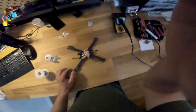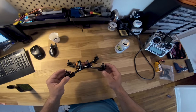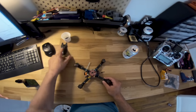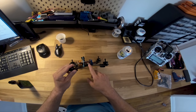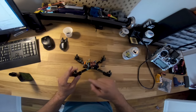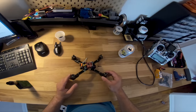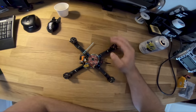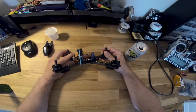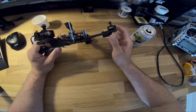More to come. Okay, got her about done. I figure we'll go over the components in a little more detail before I put the lid on her. So we got the Wraith 32-bit version 2 ESC, the copper shield that's grounded, the newest Helio, running the Odin, which I believe is the most recent Odin firmware, and it's flipped over to add a little more insurance for protection from noise from that noisy ESC. We have a Unify Pro down there, hooked up to straight LiPo, of course.